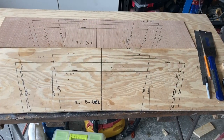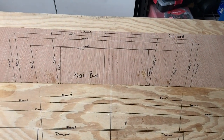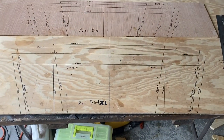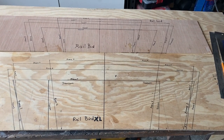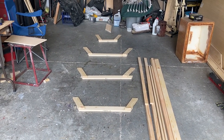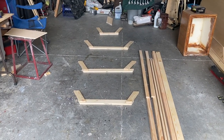It'll make this process a little bit easier to build. I've already done it before — the strongback's already set up, so this should go pretty quick. The best way to set up these frames is to just draw it on a piece of plywood. I have all the pieces pre-cut and all the frames are laid out. It's just a matter of running some screws in them, using some epoxy to glue it together.